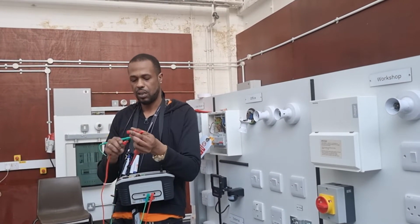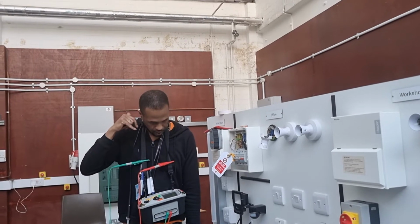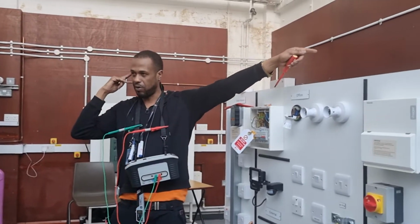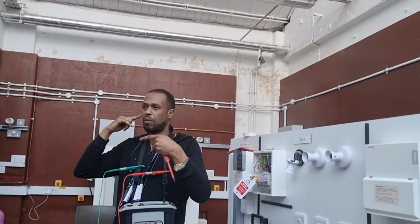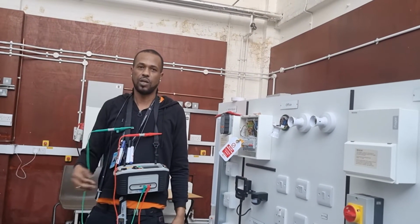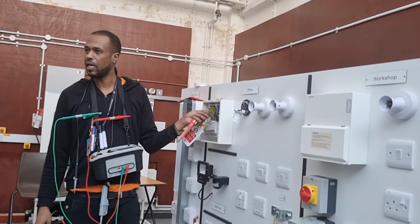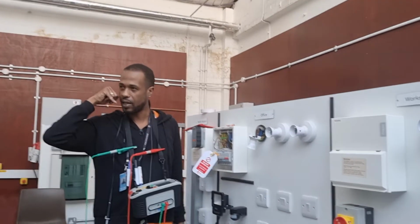Might I pick up my phone and ask, is it possible if I could get... DNO? The DNO. So if I'm on my phone and I'm asking someone on the other end, what am I doing? I am communicating, but what kind of communication is it? Am I making an inquiry? Yeah. So the ZE value can be found by three ways, can't it? One, calculation. Two, direct measurement. Three, DNO inquiry. Correct?